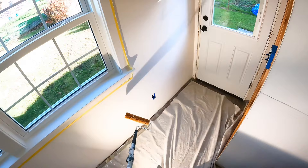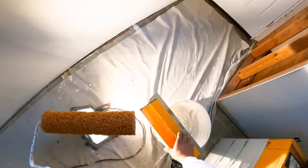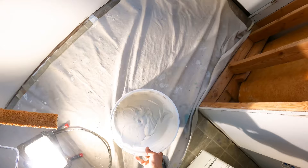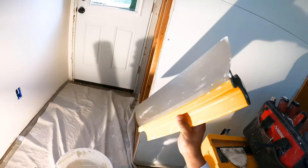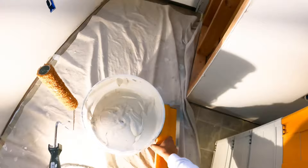I'm going to show you guys the easiest way to skim coat a wall. We already did a coat on this and pre-sanded it, and now we're going to do the final skim coat. All you're going to need is a textured roller, all-purpose premixed joint compound mixed a little thin, a Tape Tech skimming blade — this is an 18-inch — and just a 5-inch spackle knife.